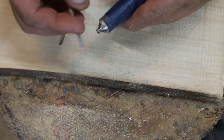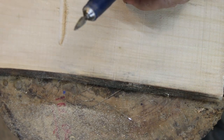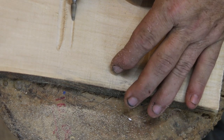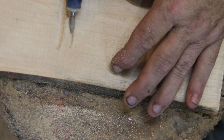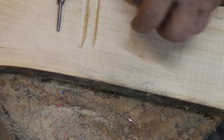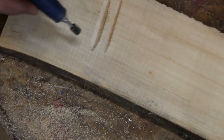The first bit on there was a flame, and here's an elongated flame — a little finer line. As you can see, that's fuzzing up quite a bit. Bird carvers don't like basswood — the professional ones like tupelo because it won't fuzz like that. I can live with the fuzz; I just have to run one more bit over it.